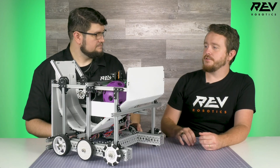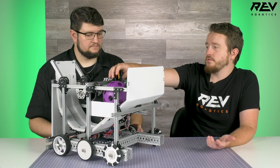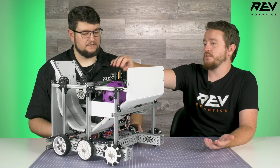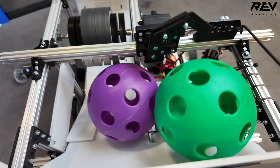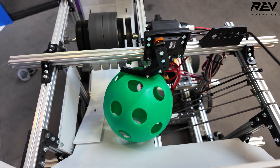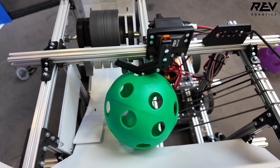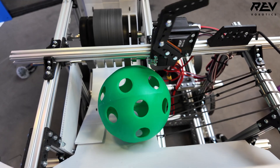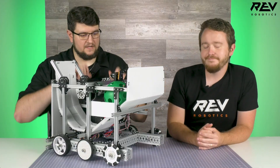What is this servo doing? This servo actually wasn't in our original design. We built this robot and then we realized that we needed an active agitation somewhere up here to keep things from jamming up. This will spin a small arm around and as it spins, it'll constantly agitate. The agitator will spin and push the artifacts up out of the way, bouncing them so they'll end up going in. That active agitator is really necessary to keep things going.